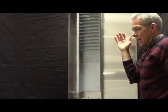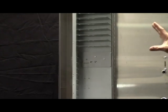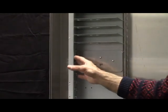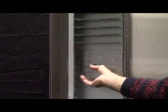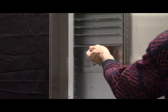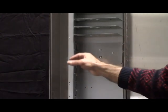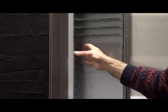Laurel is the only company that makes drop-shelf vending machines. Today what I wanted to show you is that some of the older machines will occasionally see a shelf hanging up — not dropping cleanly. You might see the shelf come down part way and hang. Over many, many years, the wear associated with the metal from here to here can cause this problem.